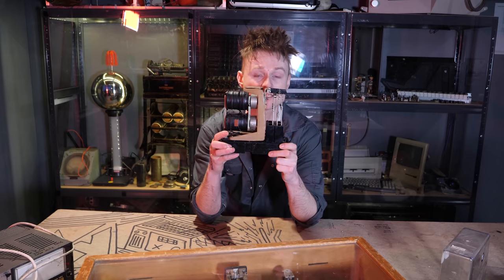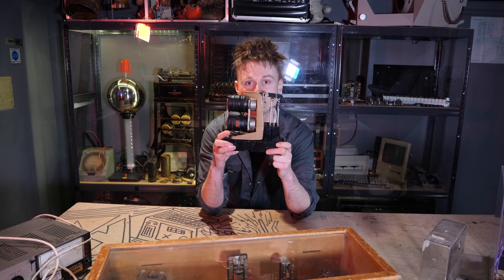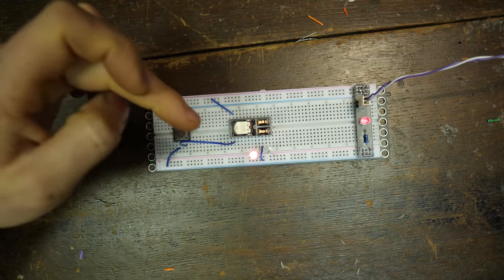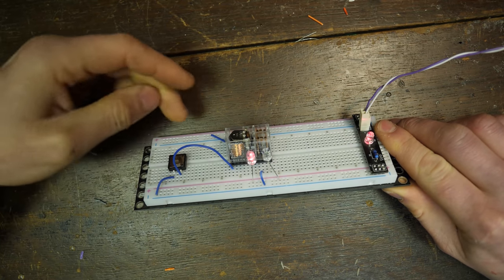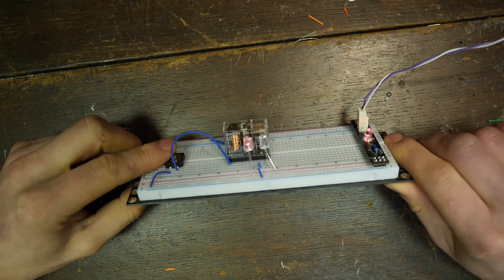If you look at a relay as something that could turn something on and off, or one and zero, then basically you've got the building block and fundamentals of digital electronics. So let's start from the top, shall we? We've got a relay here. It's receiving 5 volts. This is a 5-volt relay. You can see it's a little bit of a funky one. And it's got a switch here. It breaks the contact between the 5 volts, the relay coil, and going to ground. So when I flick this, it'll do its relay thing.